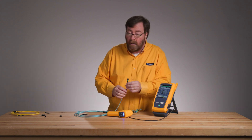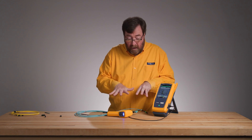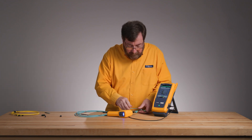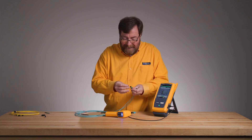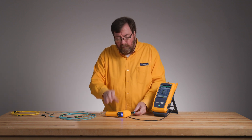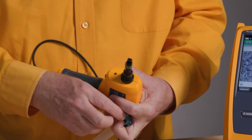While we're talking about new fiber connectors — this is a 16-fiber connector — why do we have 16 fibers? If we're transmitting at 50-gig lane speeds and we transmit 50 gig on eight fibers and receive 50 gig on eight fibers, we get 400-gig communications. It is also an angled connector. They put the angle on there because when going up to PAM-4 encoding schemes, they really want to avoid reflections. You can also see that the tip I'm using has a slight bend in it, so we can get a good focal depth on the connector.